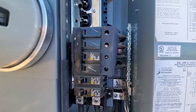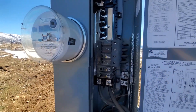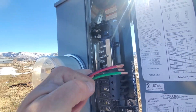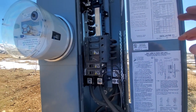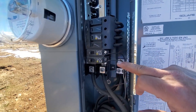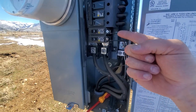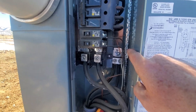We're going to find a double pole breaker where we can put this onto. You could put a double pole breaker over there and connect these wires into that. But I'm not going to make another knockout here. I've already got these two breakers — they're each on two different phases. So I'm going to just shut them off; they just feed my GFI out over here. And I'm going to wire my hot one, hot two in there, my neutral and ground onto that bus bar over there.